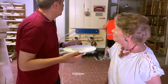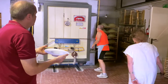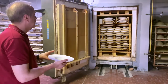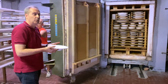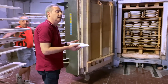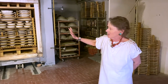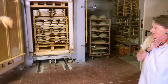Pieces are now ready to go into the kiln. The loading process is similar, with different floors depending on the size of the pieces until we complete the space. The same 26-hour cycle. The temperature changes: the first fire is 1020 degrees Celsius, the second is only 920 degrees Celsius, but we remain in there 26 hours — 12 hours up and 14 hours cooling down. At the end we have the pieces like those in the showroom.